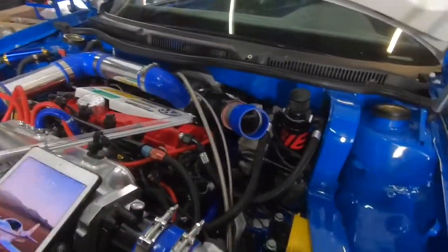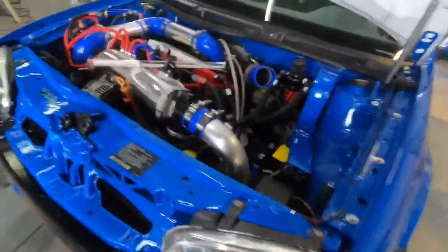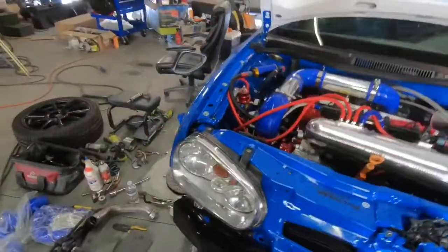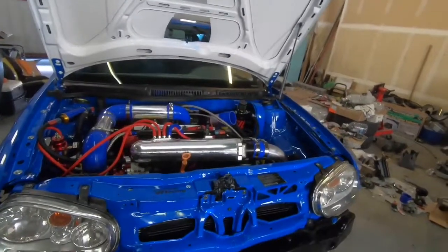Okay, so getting along with the update. I did the welding and brazing, and yeah, Aluma weld things, 15 bucks. More than enough to do a bunch of jobs. No, it isn't TIG welding. No, it isn't structural. No, I wouldn't trust my life on anything structural on a brazing rod. But I welded or brazed a couple of pieces together, and I'll tell you what, I tried to rip it apart, and it bent the metal, so it's strong in that respect.